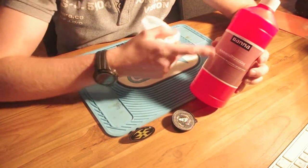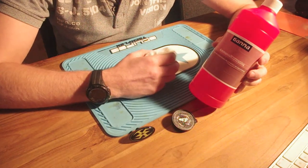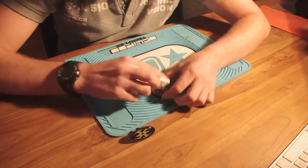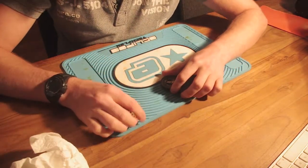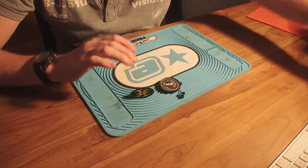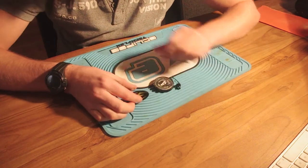When you're done with that, place the sandpaper to the side and get something to degrease the parts with. I've used an ammonia solution — whatever you have to degrease parts, just use that a little bit on a paper towel. That will make sure your adhesive sticks really well and it'll also get rid of any dust left behind from the sanding.